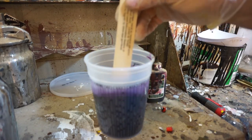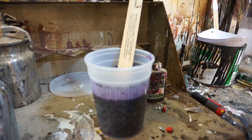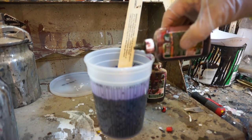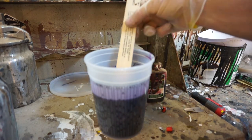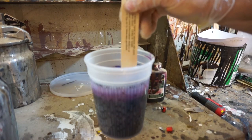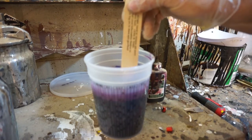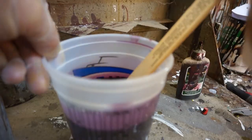So I wanted to make it all uniform and all the same color. It didn't really matter to me what color that was, I just needed to match my first shading stain to the color tones of the wood. Now I want to turn those color tones, now that we have some uniformity on the piece, and shift them over to the color that I want them to be.